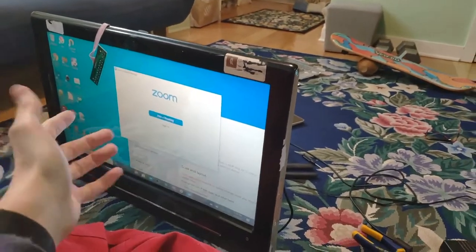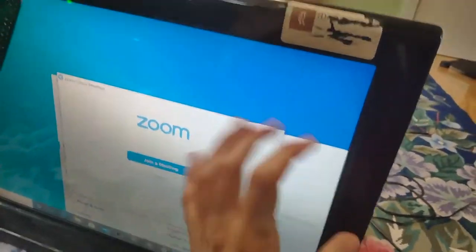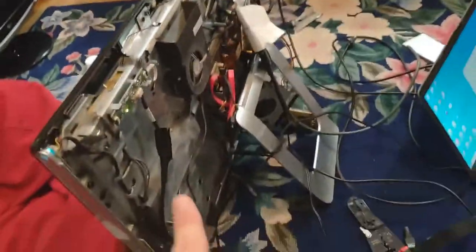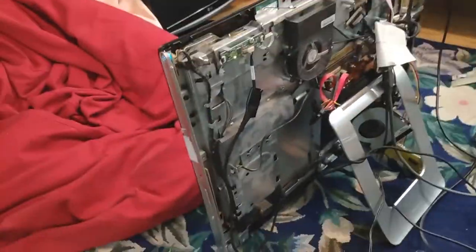Look what I have working — you can see it's a touchscreen. That's not impressive because it was already a touchscreen, except for the fact that it's not a touchscreen on that computer in there, but underneath this driver board it's a touchscreen on this computer. This is the driver module for the touch, made by NextWindow. It's an IR touch sensor, two-point, so it's multi-touch, but not great multi-touch.